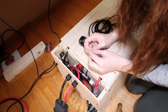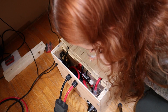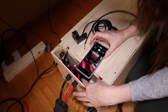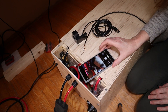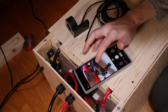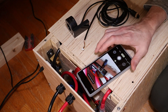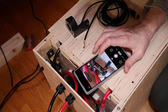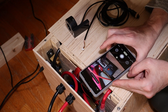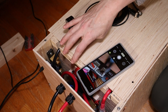What are my options? How many pins do I have here? One, two, three, four, five, six. I don't know if it's going to fit into either of those. I have the GPS and RS485 connector here; and over there it says CAN bus. But that one has four connectors and that one also has four connectors. So clearly neither of those are for this — I'm going to have to pull the BMS out after all.